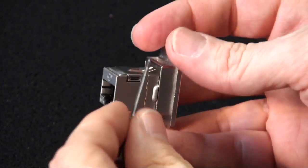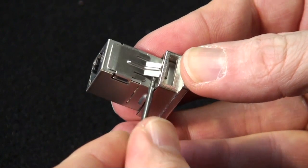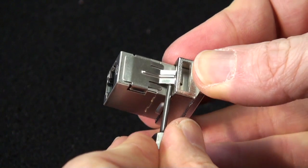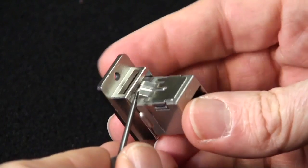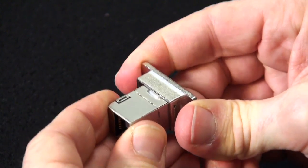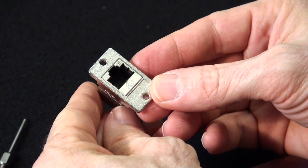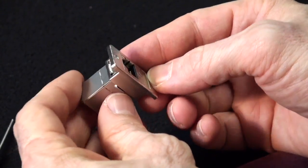To verify that it's actually in place, using the 1.5 millimeter bit, you should be able to tuck it underneath from both sides. That'll help push it up into place. Then we can test and see if it stays in place, and if it does, we're ready to put the RJ45 mounting flange back in the robot.